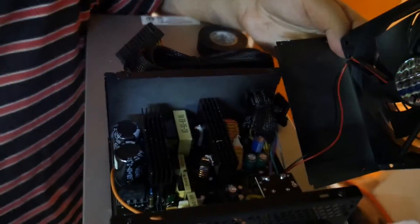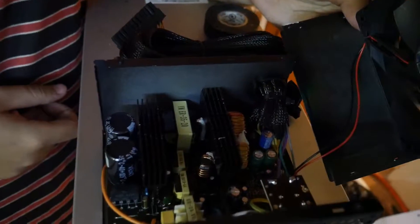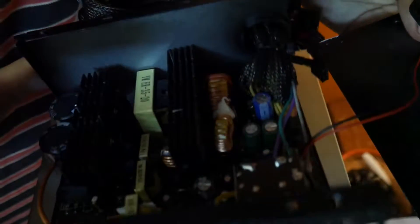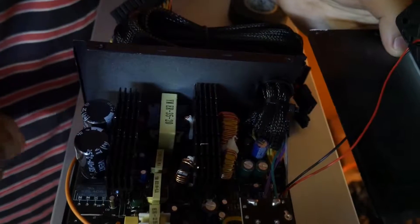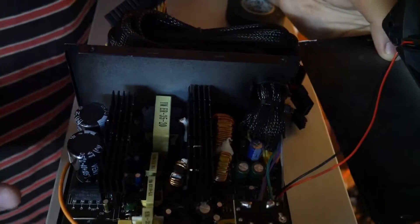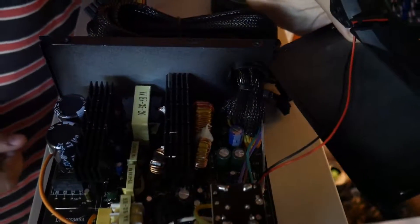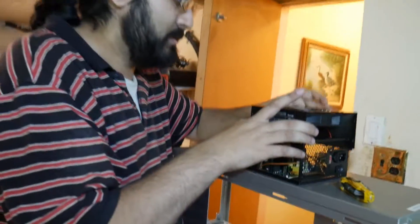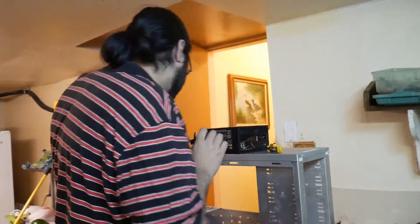This is why I think it's never going to reach 680 watts — the puny little heat sinks. It has really poor heat sinks. It has nice capacitors, but it's very lackluster. There's no way this thing is actually going to reach that wattage without something failing. Even at 80%, 400 to 450 watts is probably going to be the peak before you start getting into territory you do not want to reach.